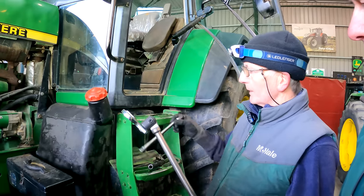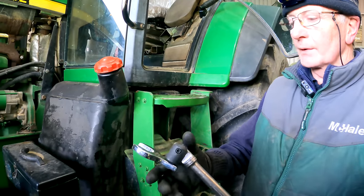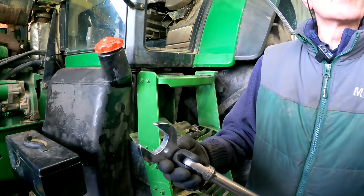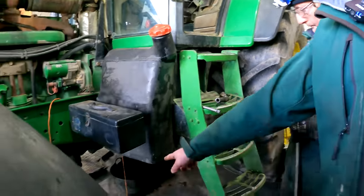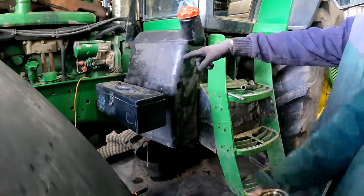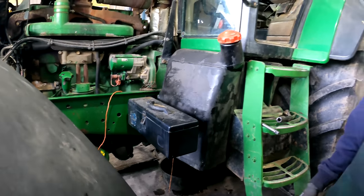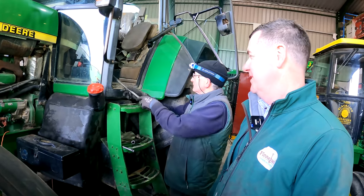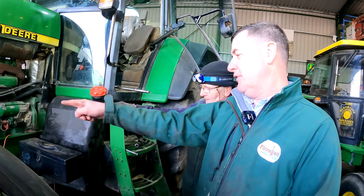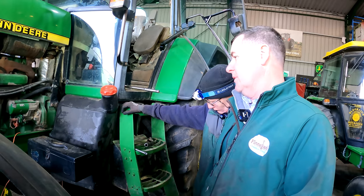We had about that length of extensions — there's the remains of one of them, we rolled it down and smashed it in half. In the end I got to loan a crow's foot off Louie McAuley — two turns and we were off. It's quite a long pipe. The whole secret: don't forget to put the baler twine in when you run the pipe back, for threading it back on. We're going to use the fish line to pull the pipe the whole way back, repair it, and tape the pipe so you don't get dirt into it.